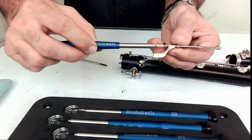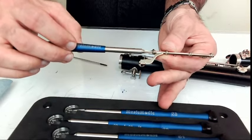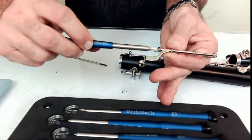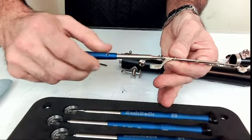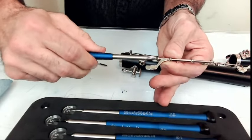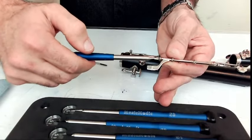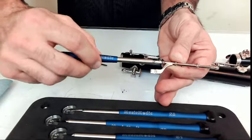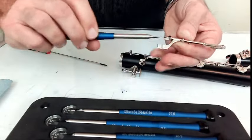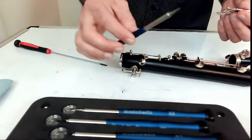If I'm doing something like this and like this, it's actually going to cut in a different way, so I've got to make sure that I'm parallel to the actual hinge tube. And then I will just turn it — I'm pushing that into the hole, but not pushing very hard, just a little bit to create pressure. The cool thing is I can turn it one way, and if I really want to, I can turn it this way too — our cutters cut both ways, which is awesome and super convenient.